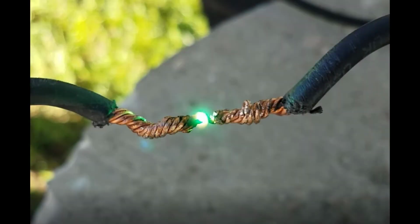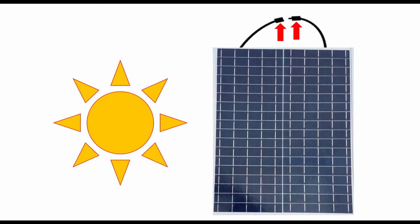The purpose of this video is to show you what can happen when a solar PV module is short-circuited in full sun, creating an electrical arc. Anytime there is light, even on a single solar PV module, there will be an electrical potential, volts, across module wire leads, so there is the possibility of electrical shock.